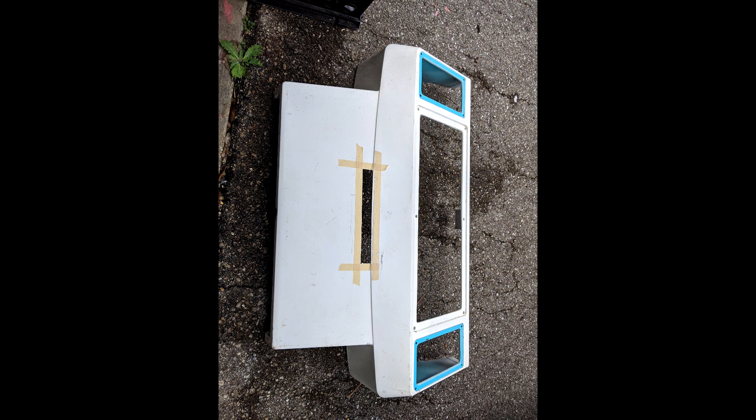Here is the first attempt at the hole. There's a ridge in the middle where the hole on the right side of the rectangle kind of bows around — the wood lined up exactly to where that bow was. I used my jigsaw and cut along that curve. On the back end I measured the thickness of the wood, about three-quarters of an inch, and cut it a little big. My first attempt was a little snug, so I went back with sandpaper and made it a bit bigger. The hole ended up pretty much exactly centered, with slightly more room on the right where the HDMI runs anyway.